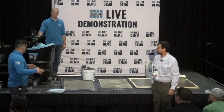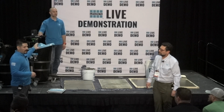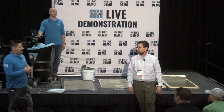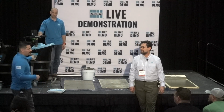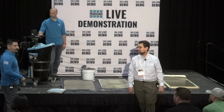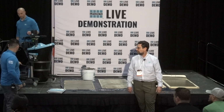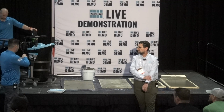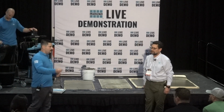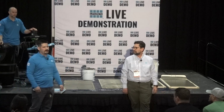So a little pro tip, and obviously some of you do that nowadays: if this is elevated with a couple pallets, two pallets, six or seven high, and you put a piece of 4x8 on top, you can position probably two of these mixers. They stay stationary, and then you have these carts running back and forth to the location. You're just dumping from there to there, and these never have to be disconnected from the electricity. They can just stay mixing all the time. So again, it's like a low-level production line of transporting the self-leveler to the location, effectively and efficiently.